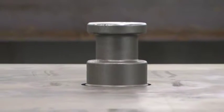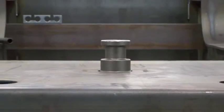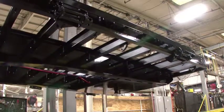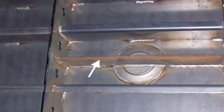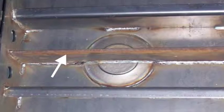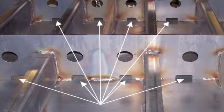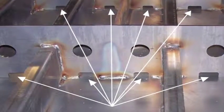The strength, design and durability of the trailer kingpin, kingpin plate and upper coupler nest is the most critical part of a semi trailer since this is the only connection point between a truck and fully loaded trailer. In addition to fully welding the kingpin to the kingpin plate, an additional heavy duty longitudinal support plate is added above the kingpin and welded in order to provide maximum strength and support. The upper coupler nest and internal supports on the Velocity are designed for exceptional water drainage while minimizing entry of contaminants.